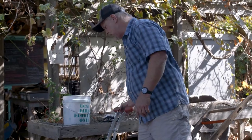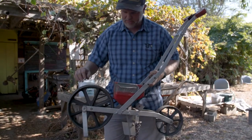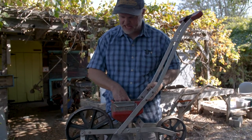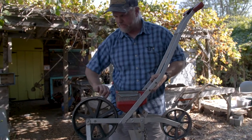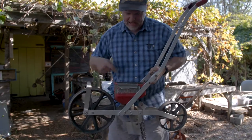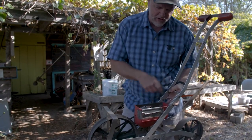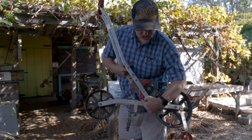because the pea plate has a big enough hole to pick up all of the different seed sizes. And as for how this seeder works, the nice thing is that it's aluminum and plastic, so it's highly maneuverable. There's a smaller hopper or reservoir here, and then the seed plate that is attached here is activated. It works along the water wheel type concept. As you put your kickstand up, the front wheel, as it's turning, is articulating the seed plate through that reservoir of seed. And then each of these little scoops essentially picks up seed, and when it gets to the top, it drops through this chute here.